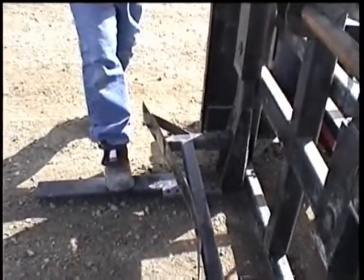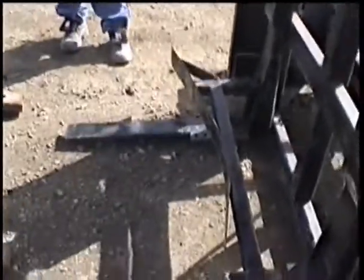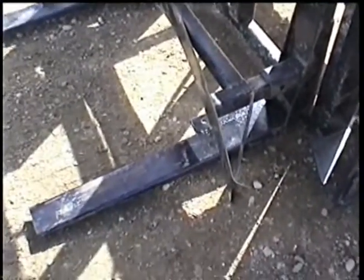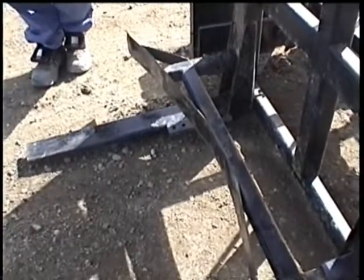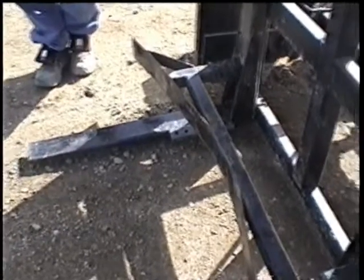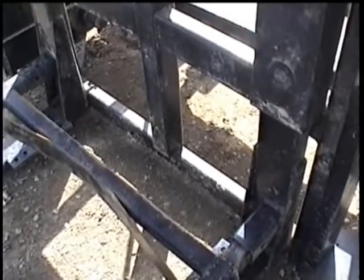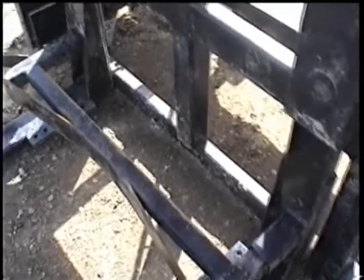We want to make sure the bumper is above the floor and the forks are below the floor. It would be helpful when pulling up to have a second person as your eyes and ears. We set this bumper system up positioned right underneath the door just to stop the bin from rolling. Some bins have skids that stick out from the floor — possibly a foot in distance — and that will cause problems. That skid might hit our framework before we get back up tight to the bin. So we carry a saw along and sometimes have to remove that centre skid because it's protruding too far.